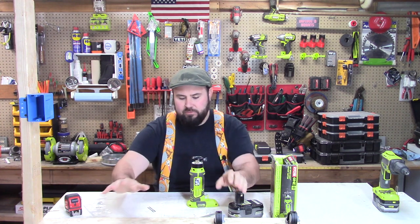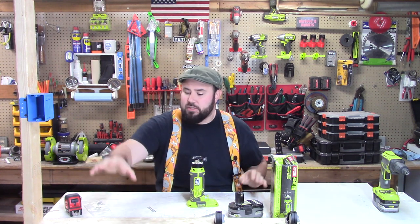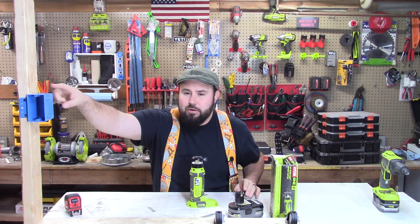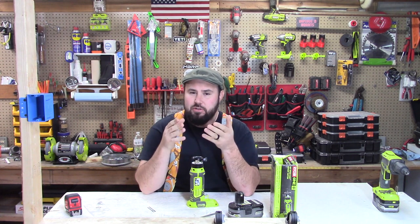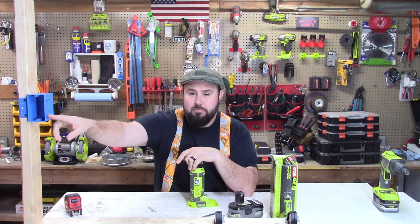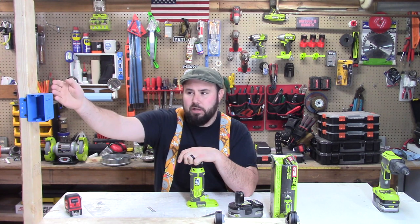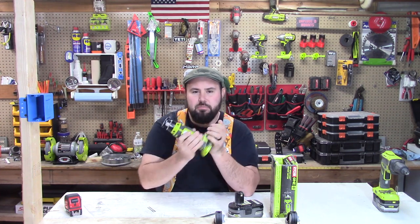As you can see, I have a couple of 2x4s clamped to the table and I have a box mounted. I'm going to take a piece of drywall, mount it over top of the box, and we're actually just going to plunge and route around the box so you can see how it works. We'll show both sides of the drywall so you have a good understanding of safety around the box — since it's plastic you don't want to melt or damage it, and you want to make sure you're not going into the stud on the stud side.